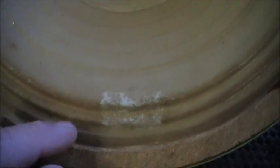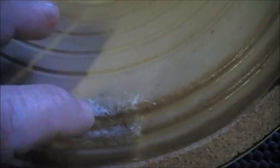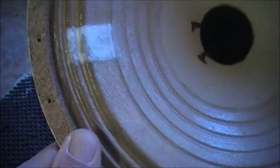There's a repair I did earlier on this speaker previously. Give you a close-in look on that. Yeah, that was just done with the tissue paper, but that was only one layer of tissue paper. Nice and strong. The PVA glue gives it its strength, depending on how many coats you put on. Right, now here's the patch I did earlier on. So there's a look at it. It'll eventually clear up a bit better, but I'll try and get you a good close look in there.